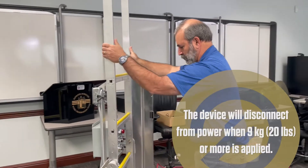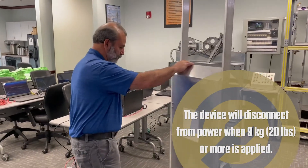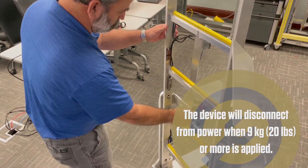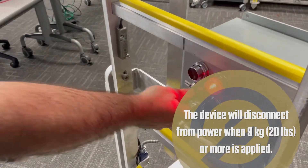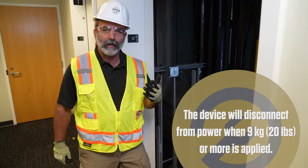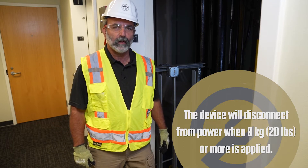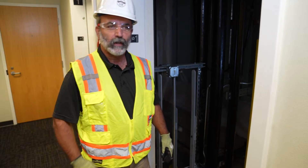When we were designing this and trying to get it into code, the 20-pound weight came about because I didn't want somebody leaning their weight or balancing on top of the ladder and not putting enough weight on it to trip. We kind of came up with 20 pounds as that's about how much you're going to put if you're balancing on top of that ladder with one foot. So now that we've got our weight hanging, we're going to go to the machine room, unlock, and then come out here and try with our access switch to see if the 20 pounds has the car shut off.